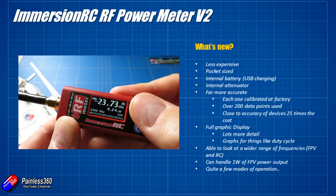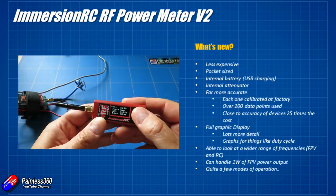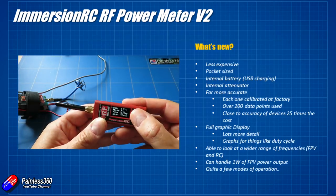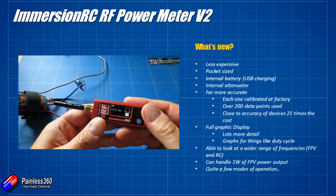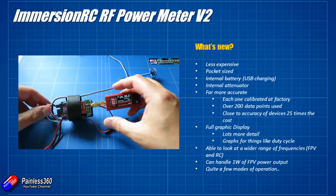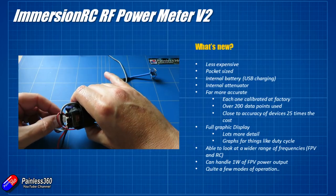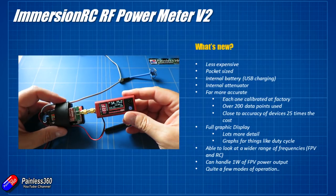Be careful — this is designed to plug in and test things briefly. It's not the kind of thing you're going to leave plugged in for 20-30 minutes at a time. That attenuator will warm up as it dissipates energy and as it warms up the resistance will change over time, so it will get less accurate. The best thing to do is use it at room temperature, plug it in, take your measurement, then unplug it and off you go.